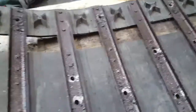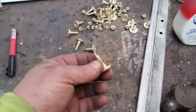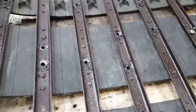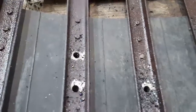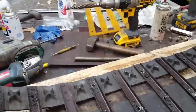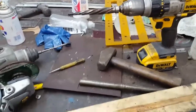The second step: I'm using a seven millimeter diameter carbide stud — it's a Woody's product. It's a 750 long, seven millimeter diameter. Your first couple holes you'll be able to slip the stud through, but as the carbide starts to wear down on that hammer drill bit you can't slip it through after just a couple holes. So what I used then was a tapered ream — after drilling, spray some more lube on the holes and go back in with a tapered ream to open up the hole just slightly. It cuts really well. I used two hammer drill bits to do the whole track and one tapered ream. No wear on the tapered ream at all; the hammer drill bits got beat up pretty good.